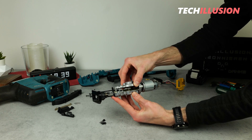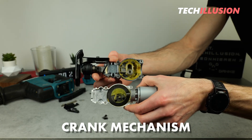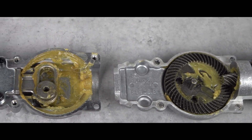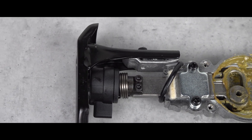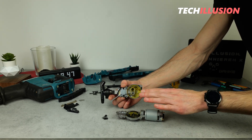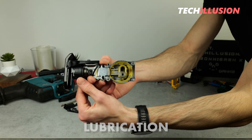Nevertheless, the screws are out, and now we can take a look inside the gearbox. And there it is — the heart of every reciprocating saw: the crank mechanism. One can say that the first thing that breaks in a reciprocating saw after many years is this unit, because we have a lot of movable mechanics here. After several years, this crank mechanism may be worn, causing the saw to move very difficultly or not at all. To ensure the saw has the longest possible lifespan, the whole mechanism is extremely well lubricated. This way, we have very little friction and maximum durability.